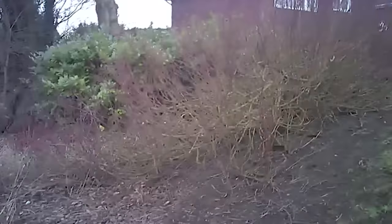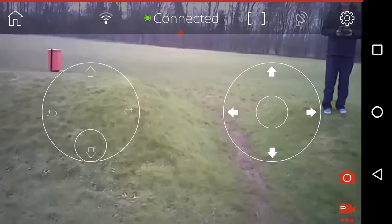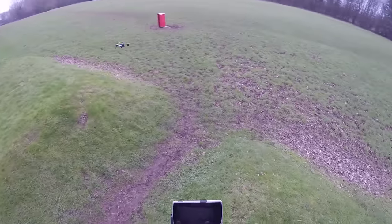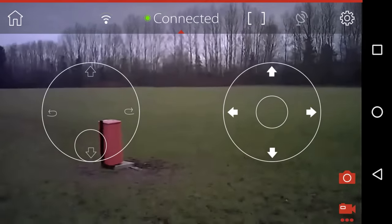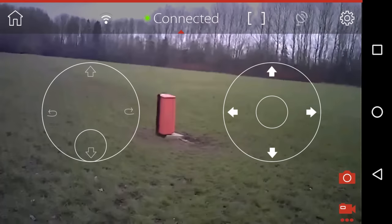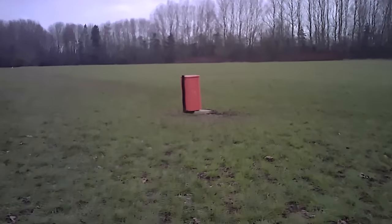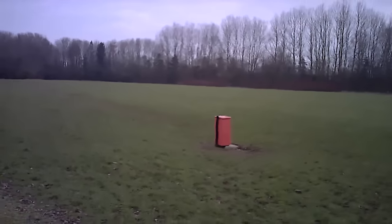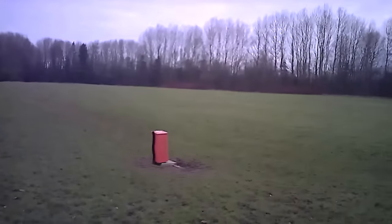The quality recorded to the phone is good enough for me compared to the aggro that you have to go through to get 720p by installing the cable and flying line of sight to get that 25 frames per second. If you choose to install that cable and put an SD card into the camera and start video recording via the phone app then a 720p at 20 frames per second video will be saved to the SD card as well as a 640p video to your phone but that will then record at 20 frames per second — I guess that is due to the extra load on everything. So the best option for me is to record just via the phone app at 640p and 23 frames per second and I can monitor what I have recorded back on the phone directly after the flight. Due to my tests the Android and iPhone apps are both exactly the same latency which is nice and consistent.